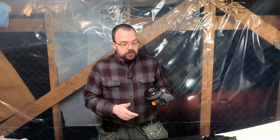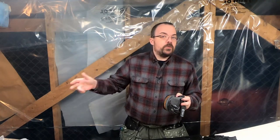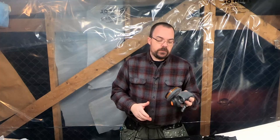I know people have commented to me and said you should use a mask even when you work with epoxy, but because epoxy doesn't have the same kind of things in it that the polyester has, I'm actually not using it then. But whenever I'm sanding, especially if I'm sanding epoxy that is not really cured. I mean, the cure process for epoxy is usually somewhere between a week and a couple of weeks. If I did some epoxy work, and then it goes 2, 3, 4, 5 weeks, then I'm not using gloves or mask.